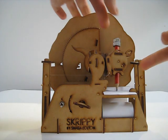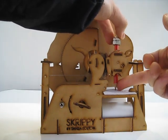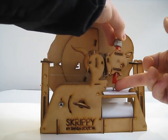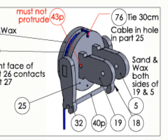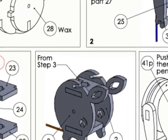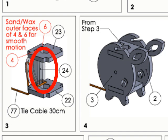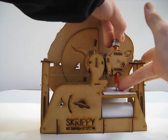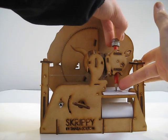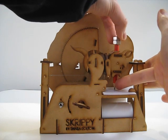The next step was how do I actuate the rotation of that gimbal. I've used strings around constant radius drums on each axis, so that each degree that the head rotates always corresponds with the same amount of string wound on or off the drum. That means when I pull the string a certain distance, I'll always get the same amount of rotation of the head. There's one string on the nod-your-head yes axis, and another string on the shake-your-head no axis.